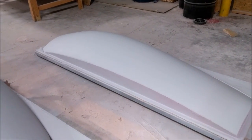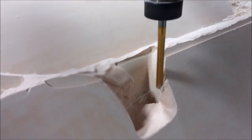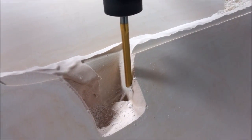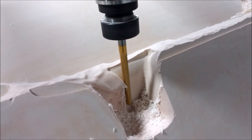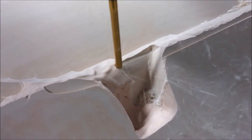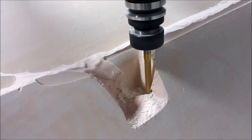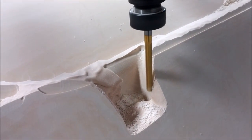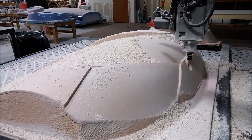After some hand sanding and another coat of primer, there are all the window plugs — three plugs for five windows. This is showing the finishing off with a three-eighths of an inch round end mill, cleaning up and carving out where the hinge points are in the doors on the right-hand side plug. The step-over for this pass was 0.02 of an inch, or 20 thousandths of an inch, so it does a nice clean job. You can see the finished product and the other one up there ready to go.